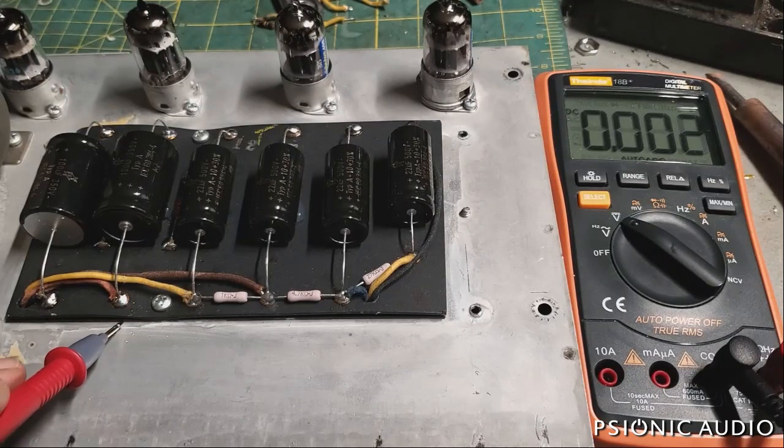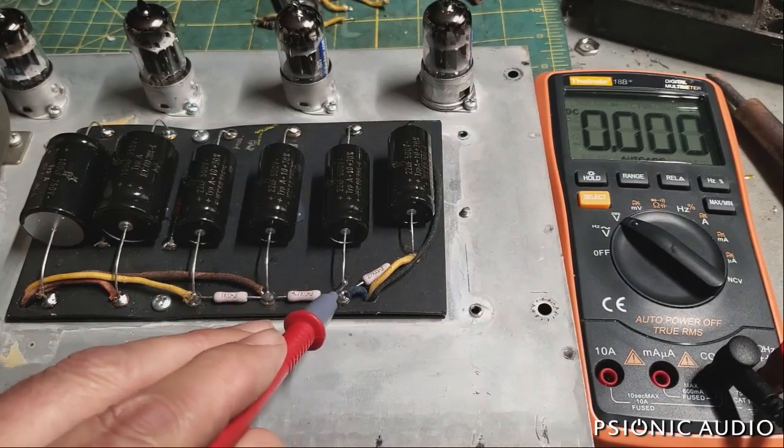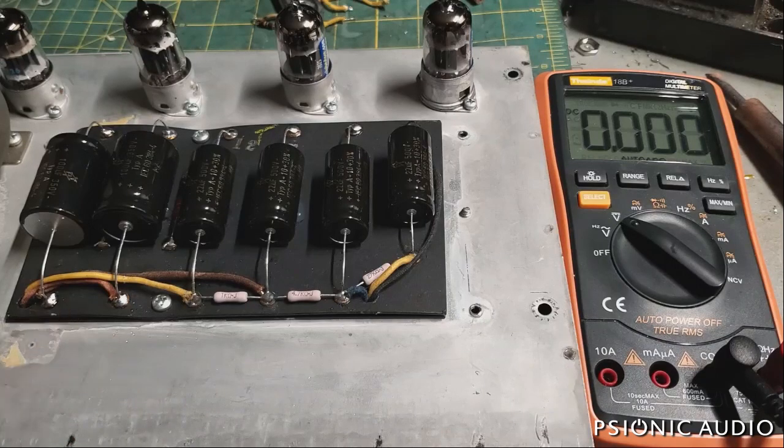This is a '67 Bass amp, and this one is designed — and I chose the capacitors I used — to have a lot of headroom, so that these capacitors can handle the highest possible level of DC that this amp provides before the tubes start drawing current, which is the worst case. Other amps are not going to have capacitors that can handle the max unloaded DC. I will point those out in later videos.